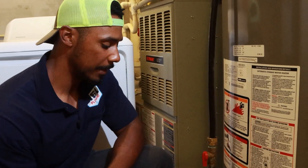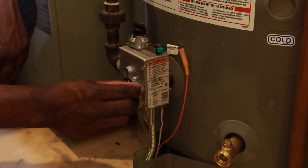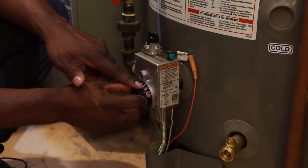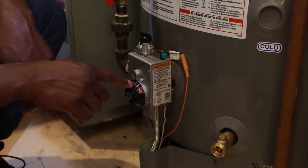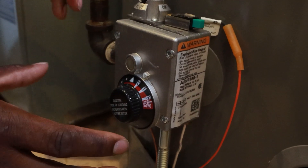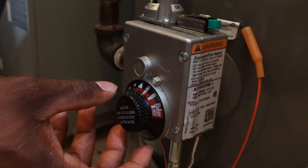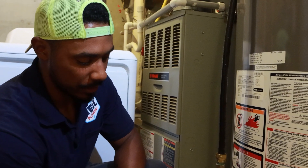What I'm going to do is grab this knob here. Most gas water heaters will have a control valve like this with some sort of knob. This is a big beefy knob — some of them have tiny little knobs that you have to twist with your finger. The way that I increase temperature is just by turning this dial counterclockwise. If you can see, there are actually letters there. The letters indicate the temperature it's being turned to: A is usually a lower temperature, B is higher, and C is, as it says right there, very hot. Right now the water heater is set to setting A, which lines up with that notch there. If we want to adjust the temperature, all we have to do is take this knob and turn it — that will increase the temperature. If I want to turn it back down, I just turn it in the reverse direction.